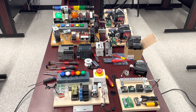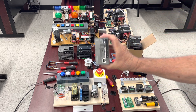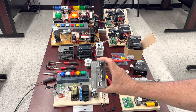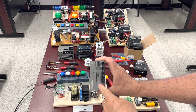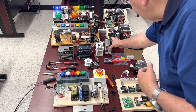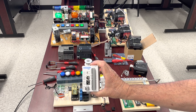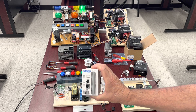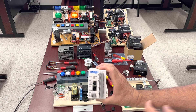First, the basic capability. I'm going to pick up this one first. That's a Pentra Smart. This one has eight inputs and four outputs — that's the basic capability. As you can see, it can be connected to Ethernet. Next is the CLICK PLC, made by AutomationDirect. This one has eight inputs and six outputs, pretty similar to the other one but with two more outputs. It also has a connection to Ethernet.